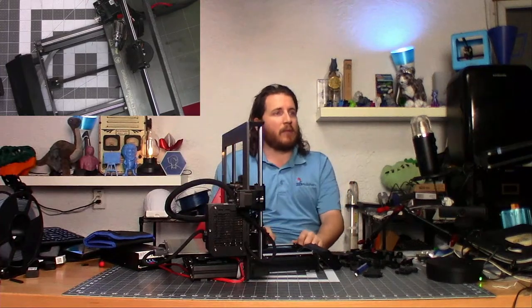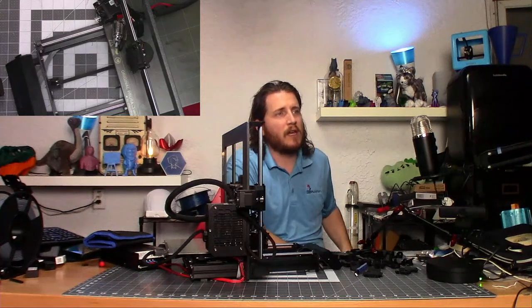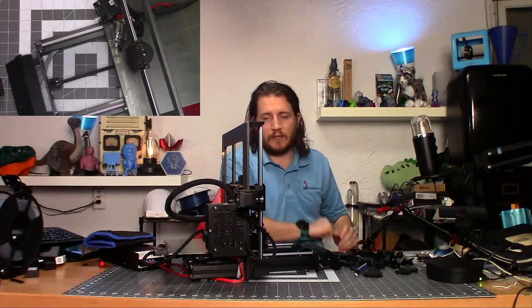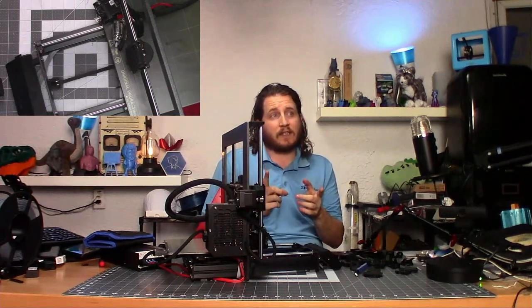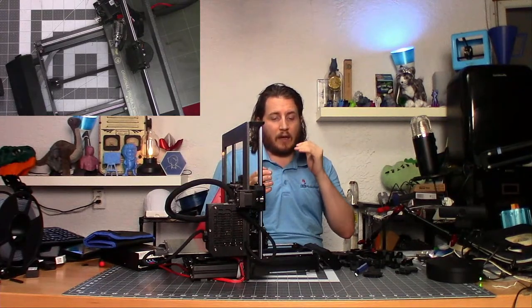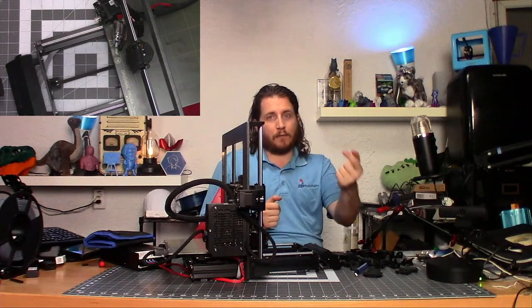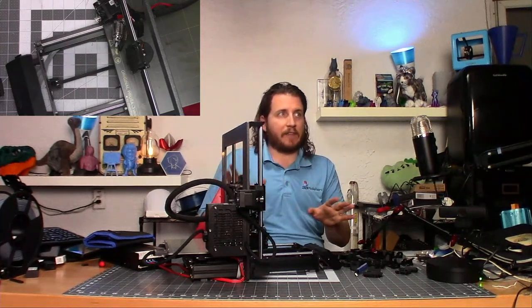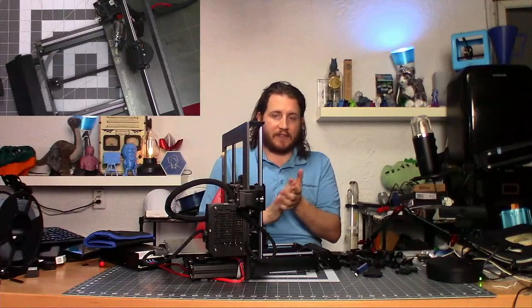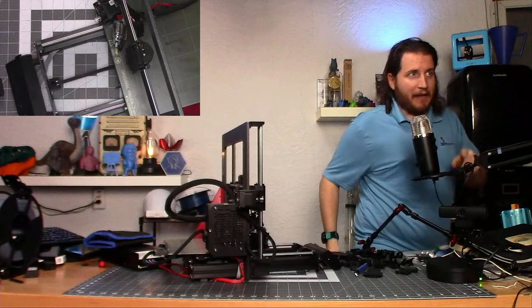T says, you might want to double check the hotend fan is actually working. I forget what YouTuber, but his fan wasn't working. He had a lot of issues. That is not what is wrong with this printer. This is a Mark 3S. That was Uncle Jesse, and the part cooling fan and the hotend fan were switched, which meant it wouldn't run. So yeah, that's not the case here. This is user error. This is someone that had a heater and it went nuclear. I know where my zip ties are. I'll be right back. I have to go get them.